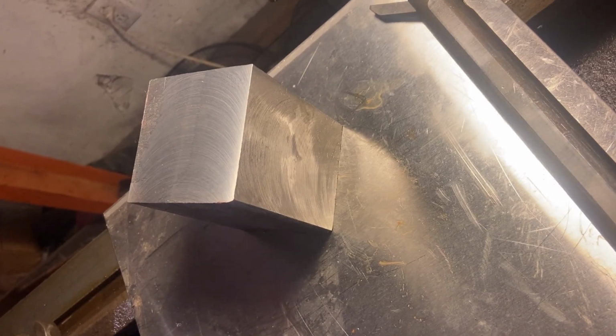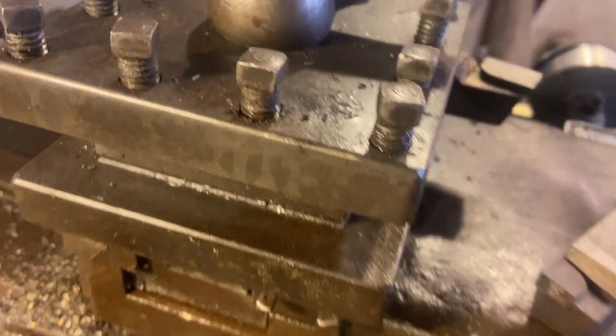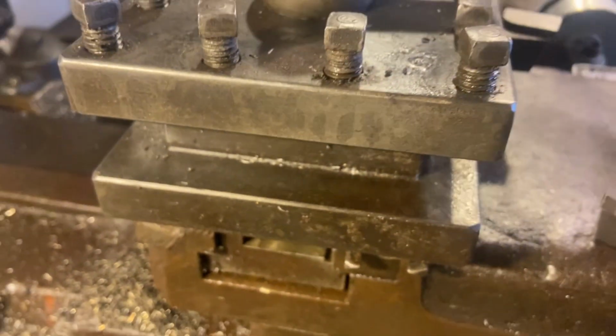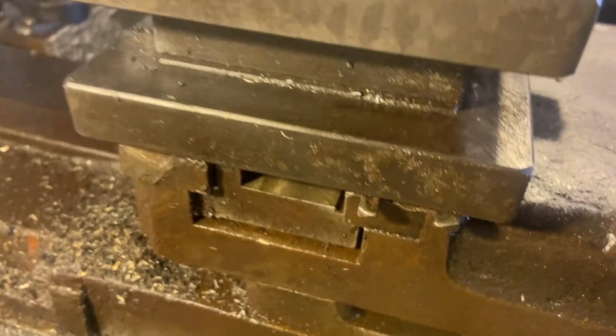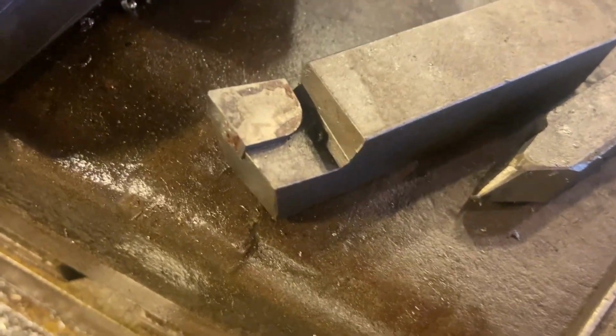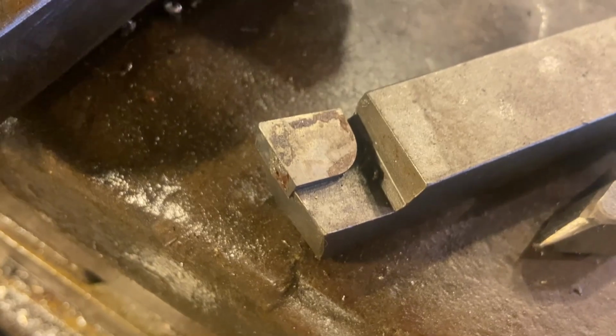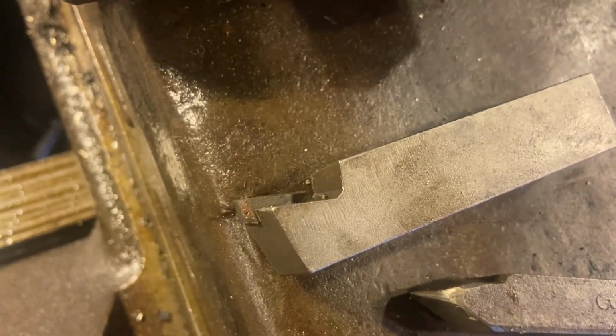So there'll be some video of the shaper running, and I have to get the height aligned up. This top lip is just slightly above the center line. And I have it shimmed because I can't really go much lower with these tools that come with it. I have a lot of tools that came with it, a lot of cutting tools. But most of them, you can see, the cutting head is below that center line.